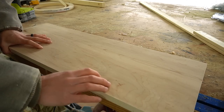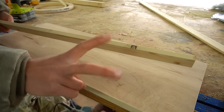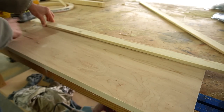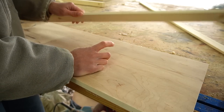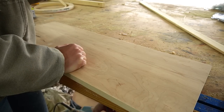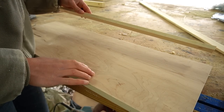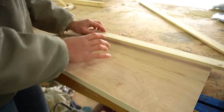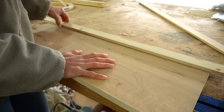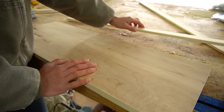Now let's move on to the door. Here's my ¾ inch plywood door — I'm going to line the outside edge of it with some lattice trim that I cut myself, about a little over a quarter inch thick. I'll cut this to fit along each side and along the top. Now, this is an inset door, and since I'm adding this trim it's going to be difficult to get concealed inset hinges to work. So if you want to use concealed hinges, I recommend going with a frame and panel door rather than the ¾ inch plywood with trim on top, or using half-inch thick plywood for the door. I'm going to use butt hinges — that's what I used on the original, with some brass colored butt hinges. There are obviously other options.